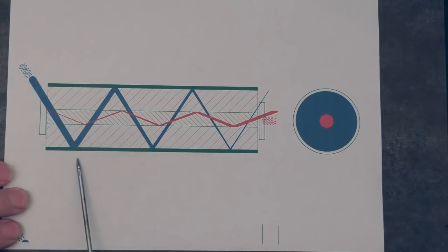Although this is a general representation, it doesn't actually work quite like this in reality. We don't have real mirrors on the end of the fiber — they manipulate the diameter of this central core using something called a Bragg grating, which causes either complete or partial reflection, giving the same effect as mirrors but without mirrors. This section of fiber could be one, two, three, or six meters long — it really depends on how much energy you want to store in the system.